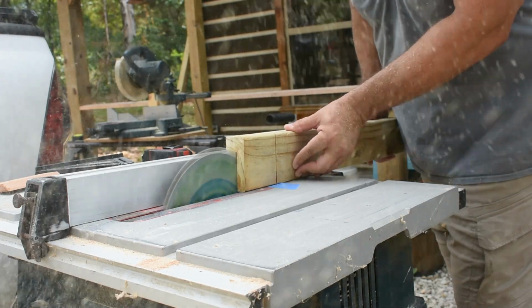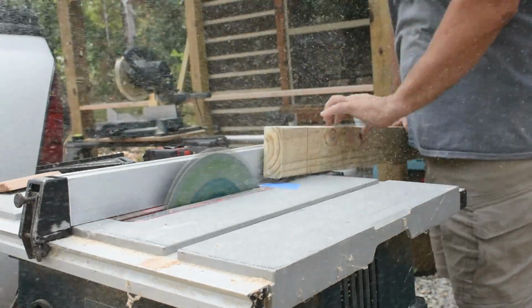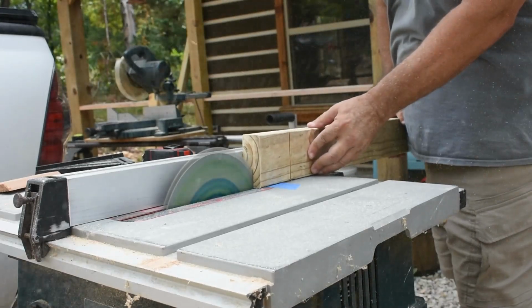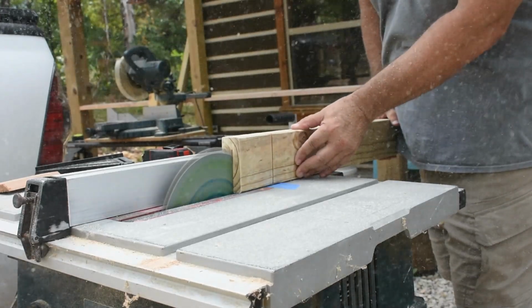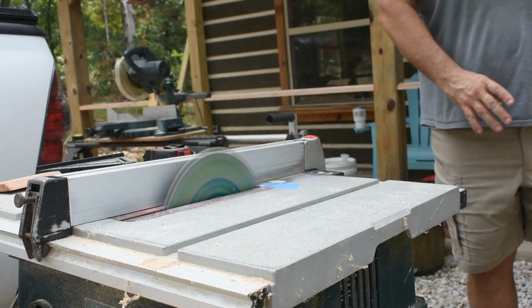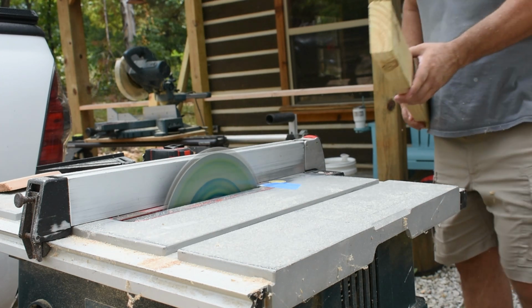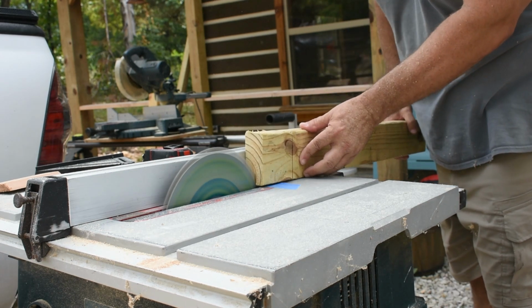Here is yet another trick for you. When cutting in this direction, obviously the blade is circular and we're trying to cut out a square notch. If you were to cut all the way to the line, or all the way through it until the material is completely removed, you'd be completely overcut and past that initial cut that we made.